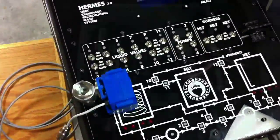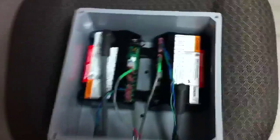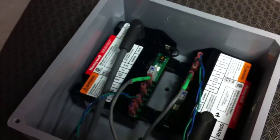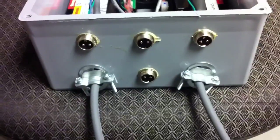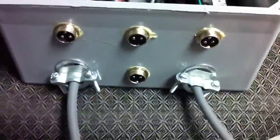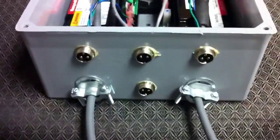There's a sub-control box off the main control that handles the burners. These are little microcontrollers made by Honeywell that control lighting the pilot lights, make sure they're lit, and control the burner valves. You can see the spark plug wires — that's what they use to spark the pilot light. These are all connected with the same type of connectors: the center two connect to the burner connectors on the main controller, and the two spark cables and valve connectors connect to the valves on the back of the brew system.